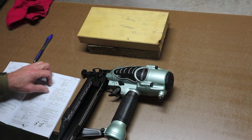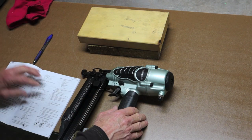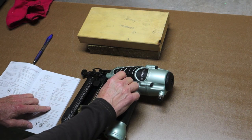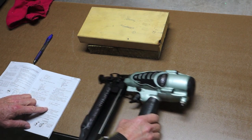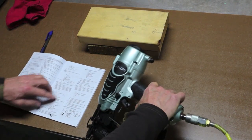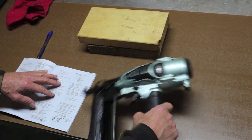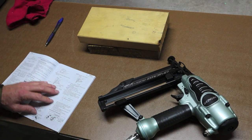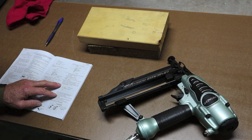Okay. We're going to set the switching device to the downward position. Take the mirror plugs out. It's called contact actuation mechanism. I think that's when you pull the trigger. It's in the down position. There and then there. And I've got to get out of the habit of sweeping my body with the nailer, just like I would a rifle or a pistol, I think. So set the switching device to the downward position completely, as shown in the diagram. Otherwise, it will not operate properly.